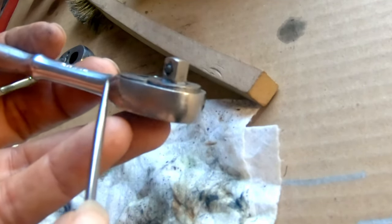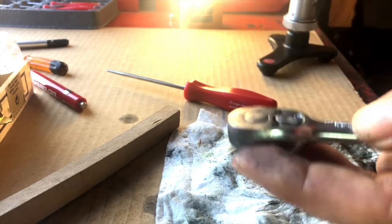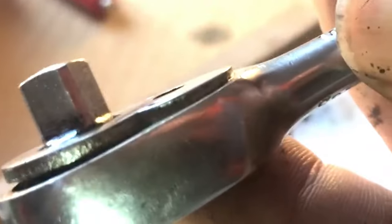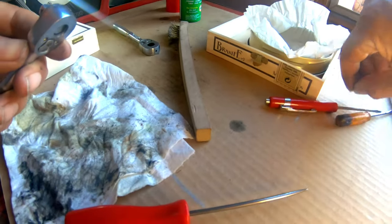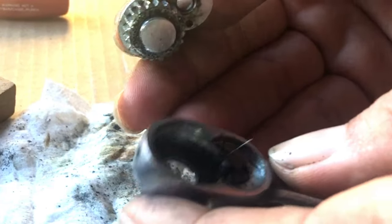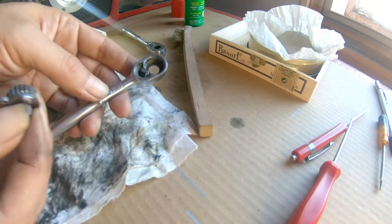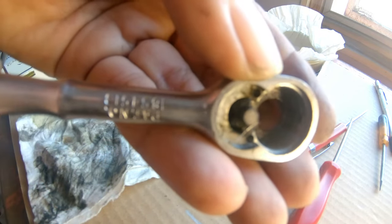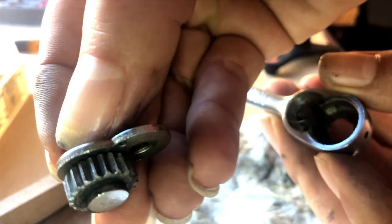You can clearly see how this side is higher than that — it's coming out crooked, which is jamming it shut. That's completely come out one side, but the other side is wedged in there. I can chase it around with tiny screwdrivers. There it goes. Jesus Christ. Look what's inside there — chunks of metal! And this is after soaking. That's why it was jamming up — there was crap in there. A big old metal splinter, basically.